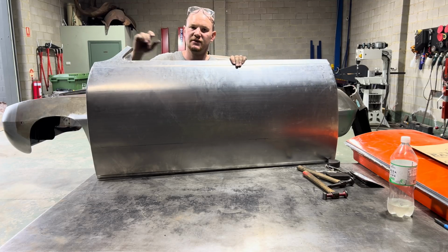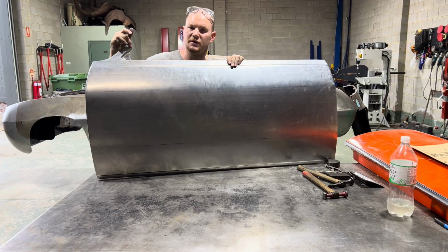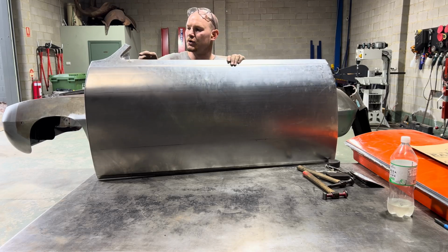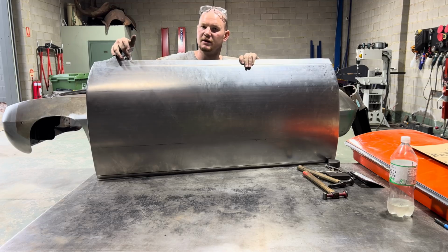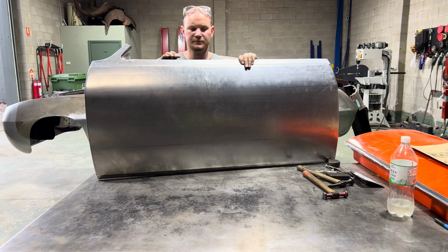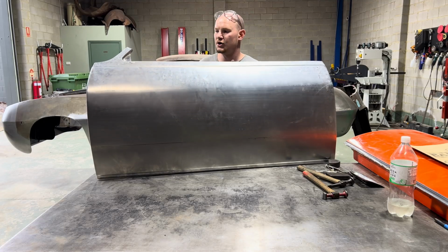just to stretch that in there, and made a little cardboard template that I could put up on the edge and get this angle of where this needed to be, and then just work by hand, just fine tuning and just cleaning up in there a little bit. So stretch the material in a fair bit. It did go quite far and it split, so I just ended up welding up a little bit just up in here. So that's all in, sort of that pillar section's done, and then all the edges are turned.